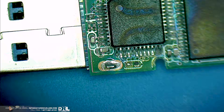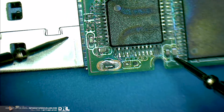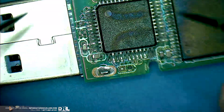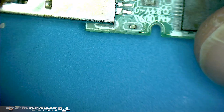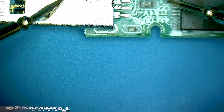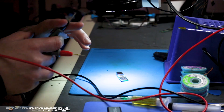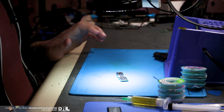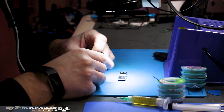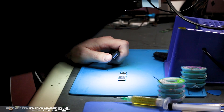I don't want to be plugging it any further because I don't want to damage the controller. I've seen where a cap has destroyed the controller. This definitely shouldn't beep. For this particular case, the best thing would be to go ahead and swap the controller and the NANDs - both of the TSOP NANDs - into a donor. I think this should be an identical drive. The tricky part is getting it open, so let's find my screwdrivers.